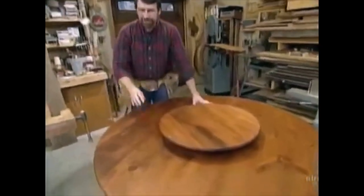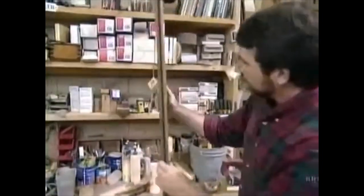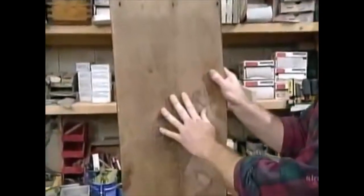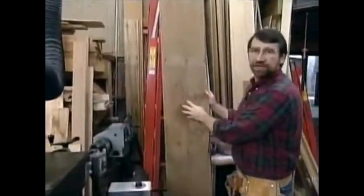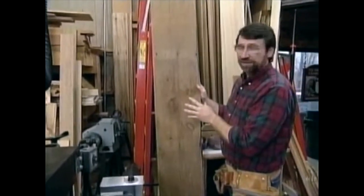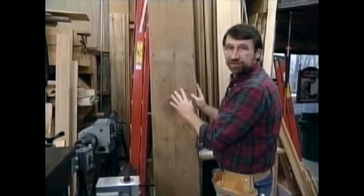The antique timbers that I used to build the prototype started out looking like this, boards salvaged from an old renovation. The objective is to make them smooth and uniform in thickness. We have a new machine to do that. In the past, you've seen me recondition these timbers with a surface planer, but grit on the boards and maybe a stray nail does a job on the planer knives. And I'm limited to width. At the present time, I only have a 13-inch surface planer.